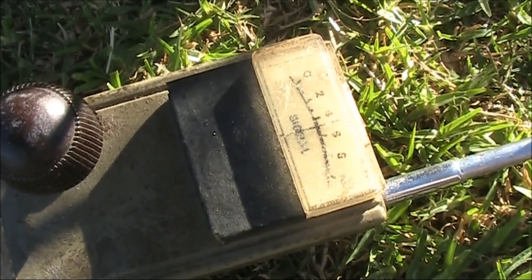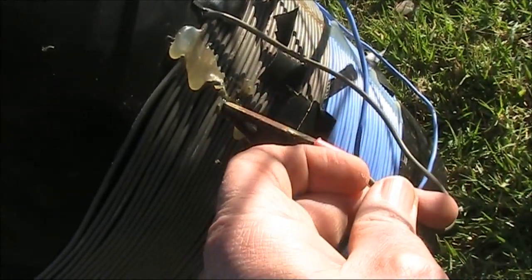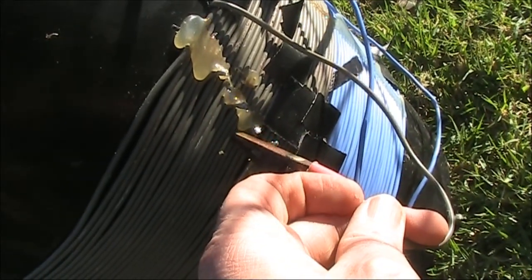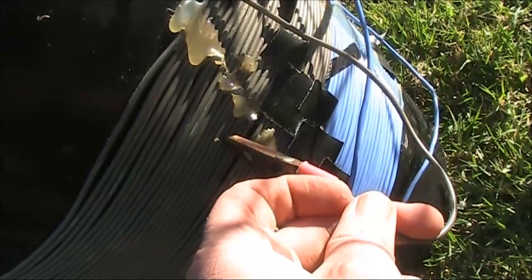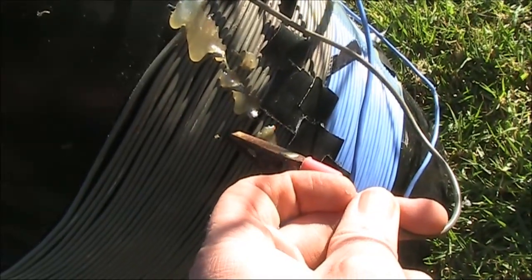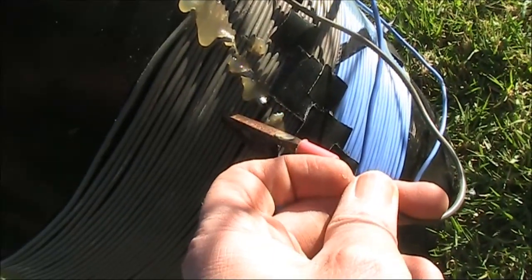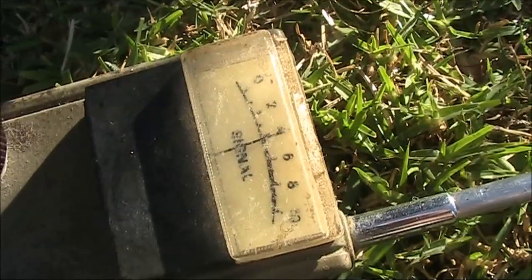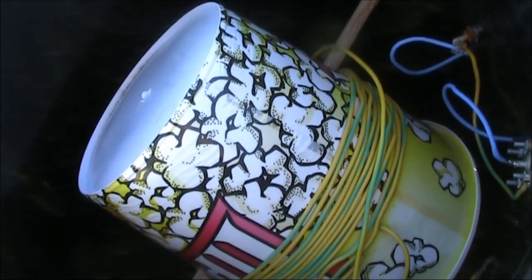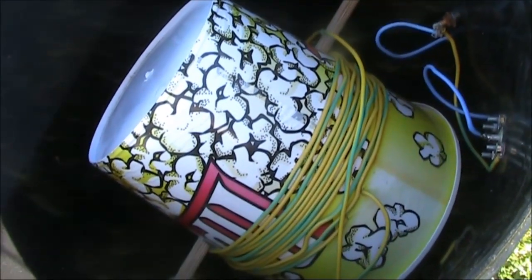I am getting some RF. A thing to note though is the tapping is different — instead of some of the coil being shorted, none of the coil is being shorted. That makes sense, since the radiating wire is much shorter, only 20 metres, than when I was at home where I was using the feed line plus the HF antenna. The tapping for the transmitter is at the same point. Moving the variometer makes a small difference, but I'm not sure that I'm spot on. There's probably still a lot of loss and some misadjustment.